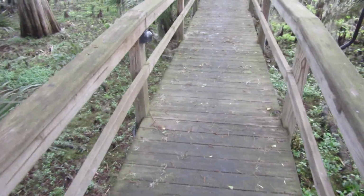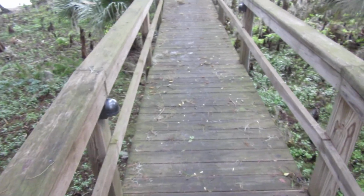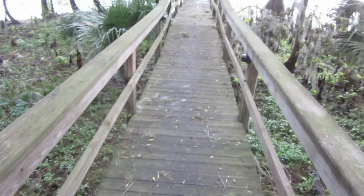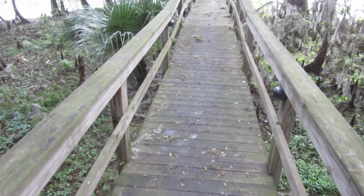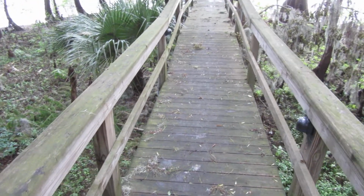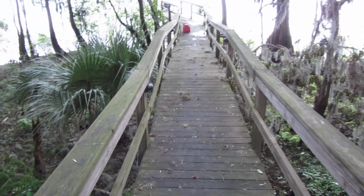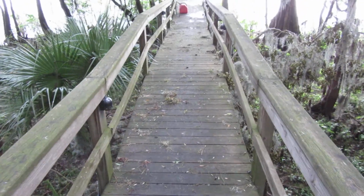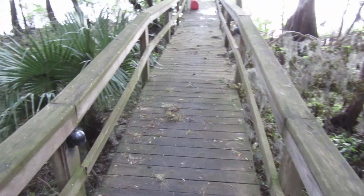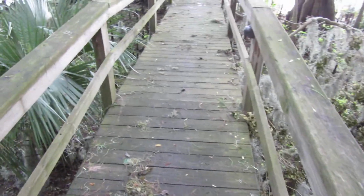And this one here, this probably has more mildew than I've ever seen on a boat dock. But I guess I've seen a lot, especially when an oil-based stain or sealer is present. You'll always see tons of mildew most of the time, unless it's in an open area, no trees at all, and the sun's just beating on it every day. But oil-based stains and sealers, they attract mildew like nobody's business. So this here has no stain or anything on it at all, and it's just mildewing really, really bad.